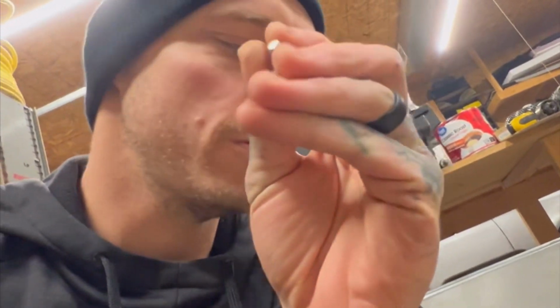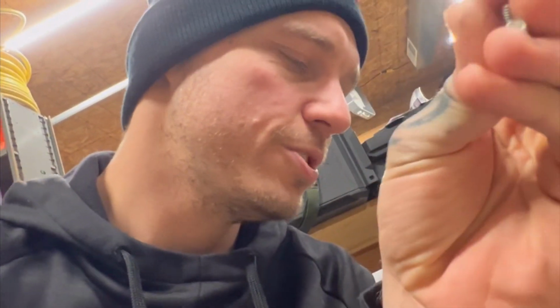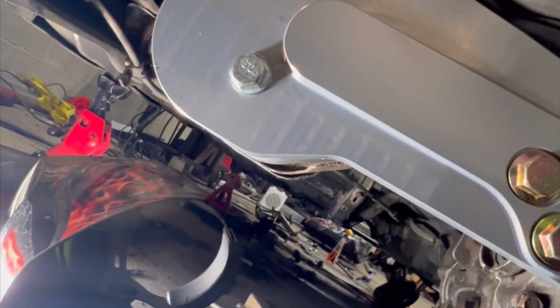But I did notice with the kit, there's these two bolts that are left over. I'm not sure if they're just for the back plates or not. But what's nice about it, it does have your sway bar mount. So if you choose to put one in, you can. Or like here, I'll show you what I did. I just installed them to the top placement right there. And for the most part, I backed all these out, went in individually, and Loctited them with red Loctite.